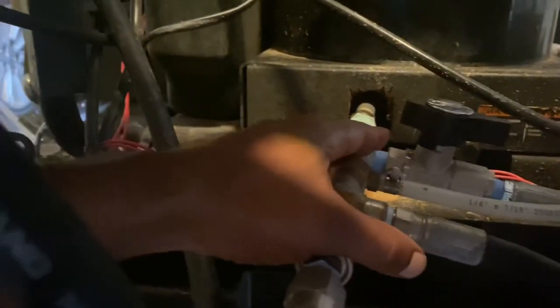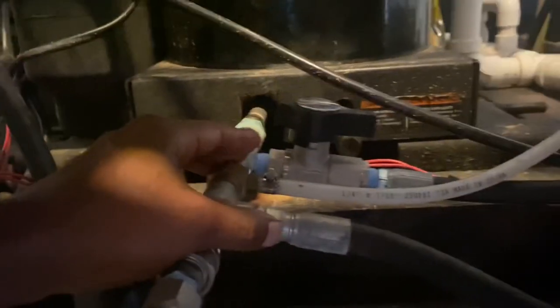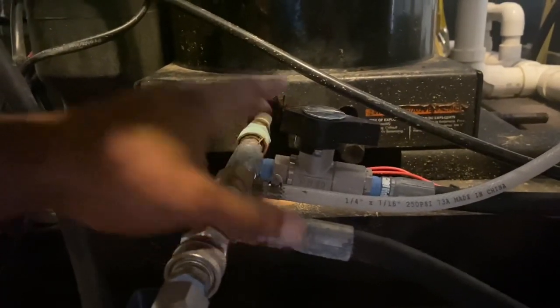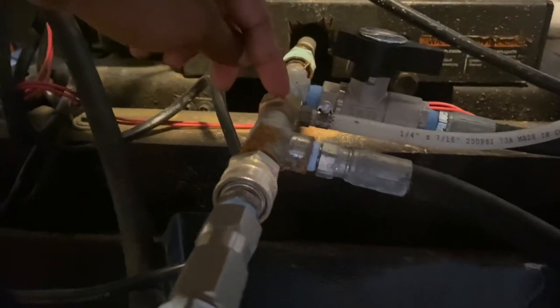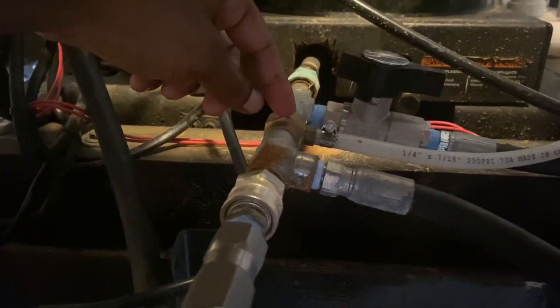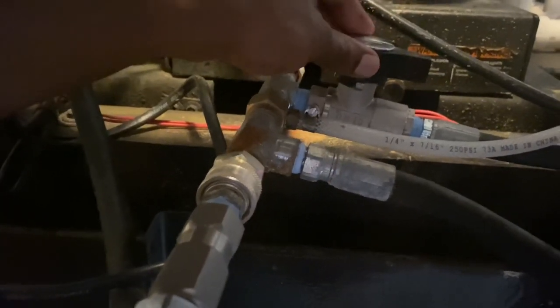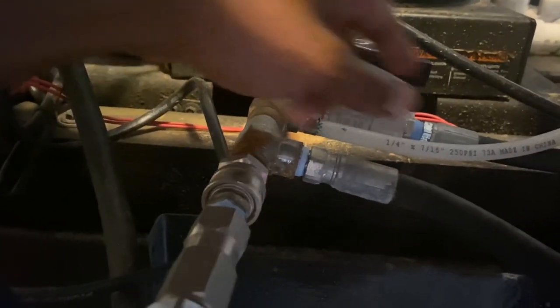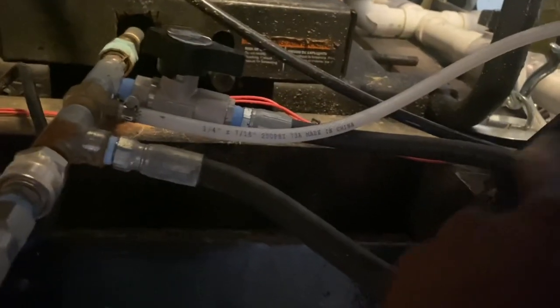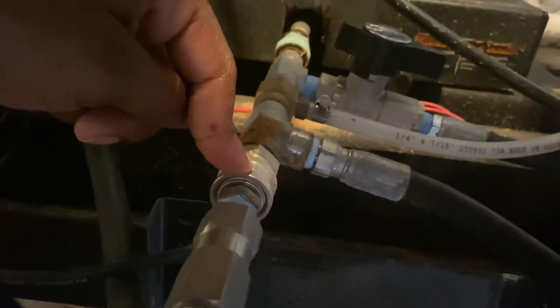Also, I have it connected with a bypass, a downstream injector bypass. You can get these online. With the downstream injector bypass, you have to remember that in our downstream injector the orifice is very small, so you're not going to get full adequate flow from your pressure washer. So the bypasses are amazing. When it's open like this right here, the water bypasses the injector and it just goes around. It just loops. It comes back in to bypass this injector to still give you adequate full flow.